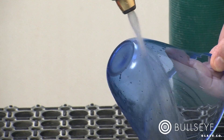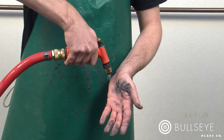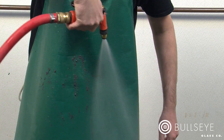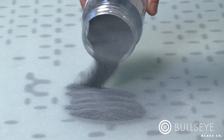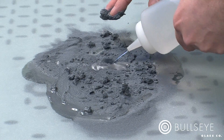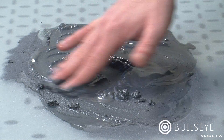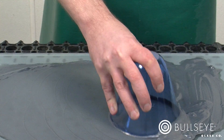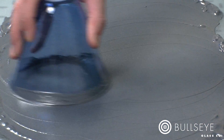It's extremely important to remove all traces of previous grits before moving to a finer slurry. Thoroughly rinse not only the piece, but also the workstation, tools, table surface, your hands and apron, and any hoses in the area before proceeding to the next grit size. Having started with a coarse 80 grit, we can now move to a medium 220 grit. Set up the slurry and follow the same procedures as before. The intention when moving up through increasingly finer grit sizes is to remove all traces of the scratches made by the previous grit.